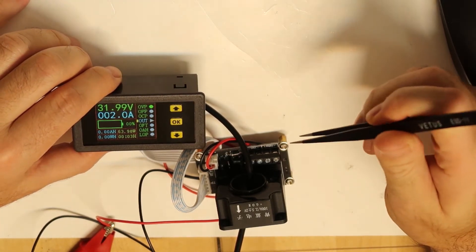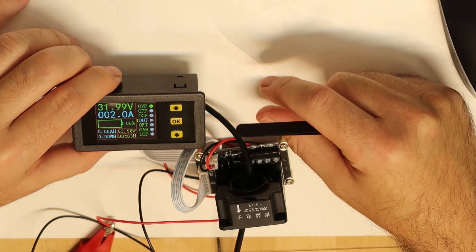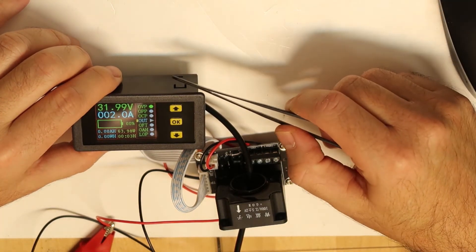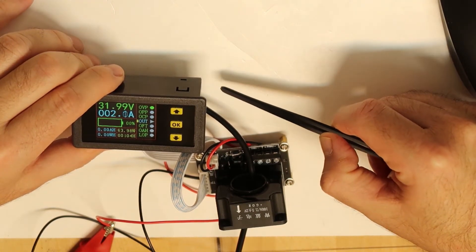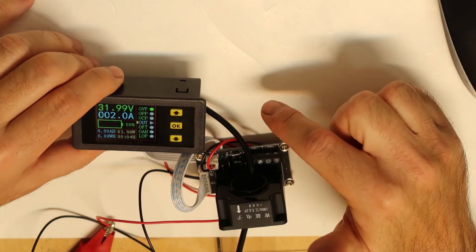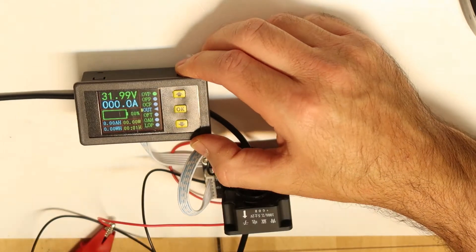The main disadvantage of this device is that the relay output voltage equals the input battery voltage. So if you are running at 40 volts, the relay coil will also get 40 volts, which is too much for most relays. They should have included a DC-to-DC converter to step down to a standard relay voltage like 12 volts, but they did not. You can add an external DC-to-DC converter at the output to work around this.